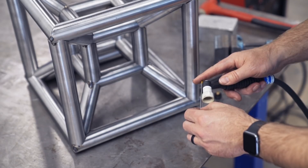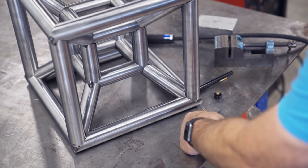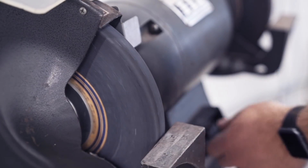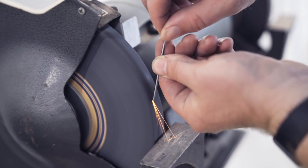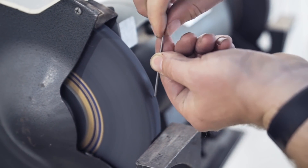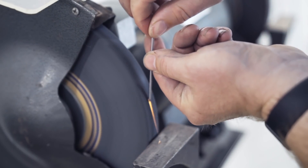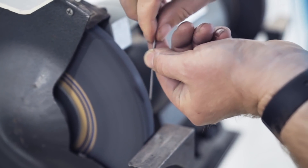When I switched to the short back cap, I didn't have a piece of tungsten the perfect length, so I had to break one. I put it on the sharp edge of a table and pop it with a hammer, then take it over to my bench grinder to get my point back on it. I just made a video about how to grind tungsten — the gist of it is to hold it pointing in the direction of the wheel going away from you so it's pulling on the tungsten. Don't put the tungsten upright where it could catch and shove into your hand.